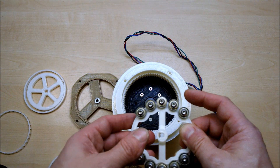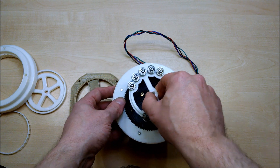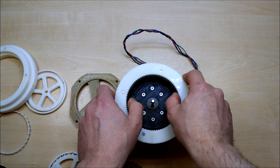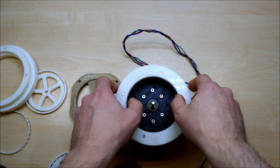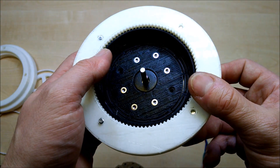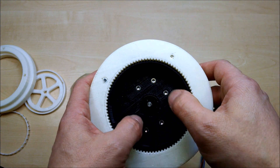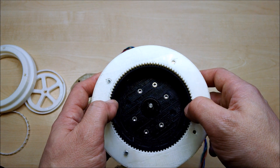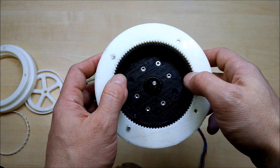The challenges in this are to do with the deformation in the belt as the whole gear is loaded up. The problem is partly to do with the extra flexibility of the rubber in the belt, but also the teeth profile. If you look at the HTD timing belt profile, it's not a sawtooth profile - it's quite rounded. What we're looking for is constant meshing for as much of the circle as possible, except the point where the teeth glide past each other at the extreme of the wave cycle to the sides. We're not getting that because of the tooth profile and the flexibility of the belt.